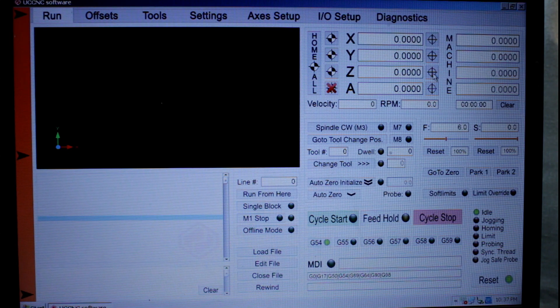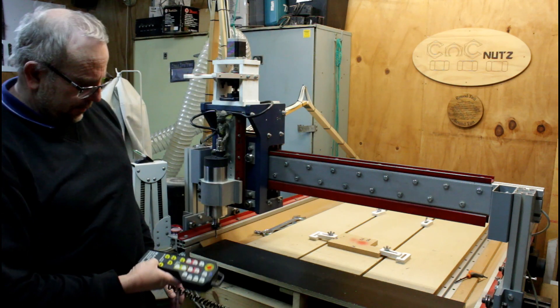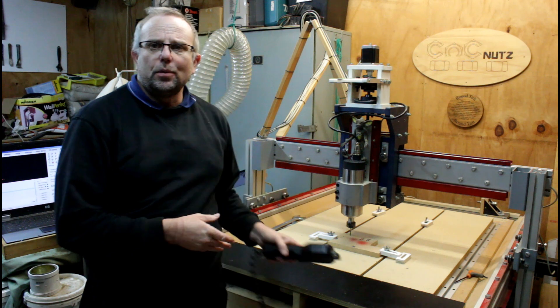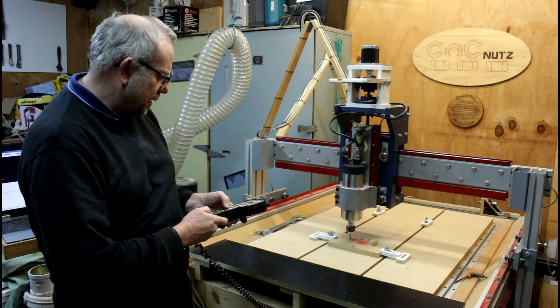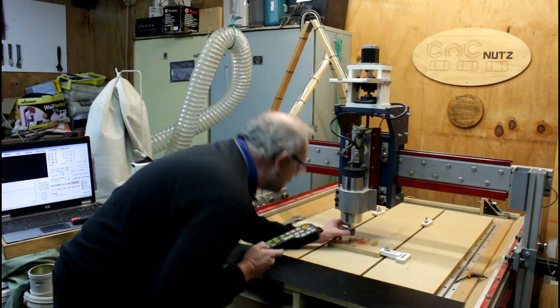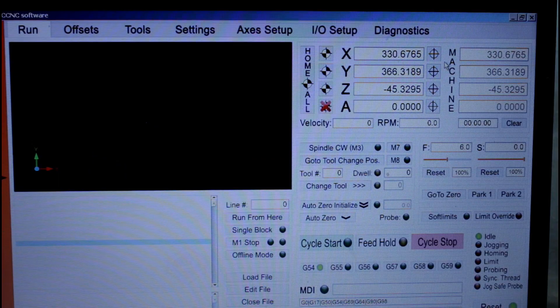Now it's time to move the machine to where we want it to go for our X, Y and Z working coordinate position. So I'll move this over my workplace, take it down a bit, and I'm just going to pick an arbitrary point and slowly drive it down until it's just sitting on the surface of the work piece - like so. I'm now going to call that my X, Y and Z zero position. You'll notice that at the moment my working coordinates and machine coordinates are the same, but I'm just going to quickly set my work coordinates to zero. This is normally what you do when you're setting up your machine to do your cut.